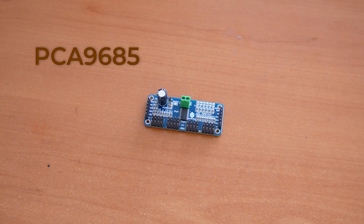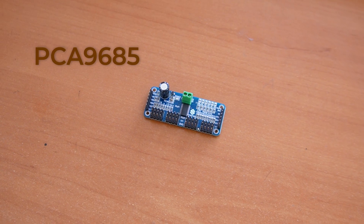Finally, here are three quick tips: always use a separate power source from the controller; upgrade to metal gears if possible for a more reliable build; and if you need more servos than your board has connections for, check out the PCA9685 — it allows you to manage up to 16 servo motors with one microcontroller. Make sure the microcontroller you are using is able to process all of that information, and always power the servos from a different source from the controller.